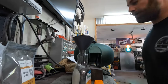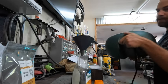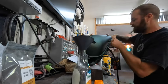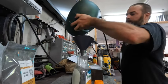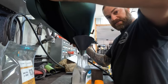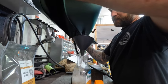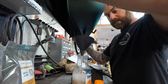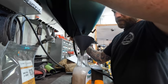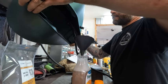30 minutes has passed. Now we're going to drain the degreaser. Being good to our environment — even though it is water soluble and I believe it's biodegradable — we're going to drain this and get rid of it properly. Follow those rules for how you get rid of your waste. Honestly, there's really nothing gross coming out of here, which I didn't expect — this thing was in pretty good shape. We're going through the process to clean this tank out. Once it's completely drained, we're going to start the rinsing and then the etching process.